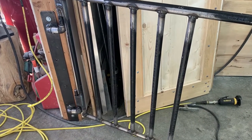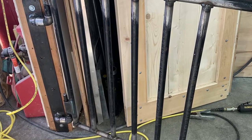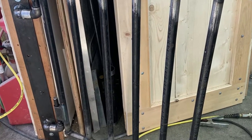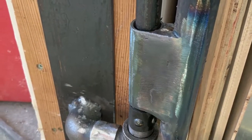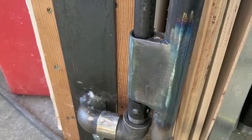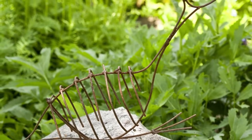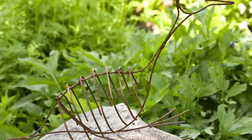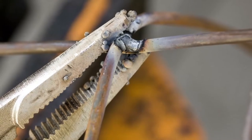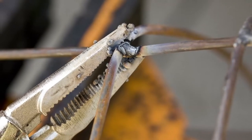This is a gate I made also from black iron pipe — it goes along with those stairs. It's made entirely from black iron pipe fittings, a little bit of plate steel, and some three-quarter-inch thick mild steel rod. This is a close-up of the hinge; I've since installed a grease fitting in there — kind of overkill for an indoor gate, but it sure does make it swing quietly. This bird sculpture is made of number nine annealed fence wire. You can cut it in pieces and weld it together for all kinds of shapes if you feel like getting creative.